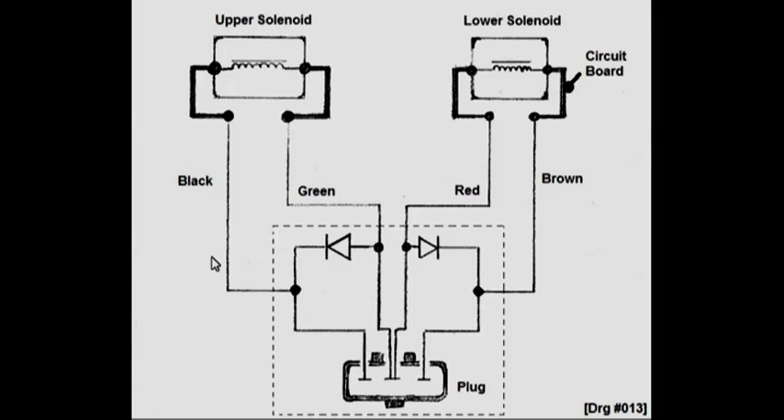Hopefully you'll never have to do that. This is a diagram representing the solenoid wiring. The colours I've shown — black, green, red and brown — are the colours that were on the exhaust solenoid wiring. The colours were different on the inlet solenoid wiring but the routing of the wires is assumed to be the same. I can't see why it would be any different. This is the upper solenoid and this is the lower solenoid.